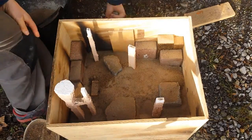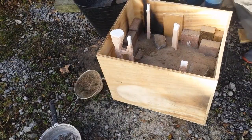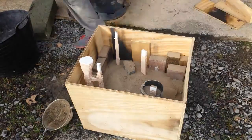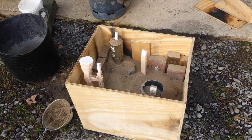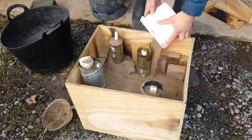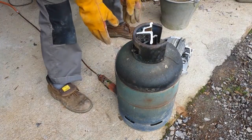We've got the foam pattern in this fairly shoddy plywood box and we're packing it round with unbonded normal dry sand. The more the sand can roll over each other the better, because when it comes to vibrating the sand into all the little nooks and crannies in the pattern it'll move better. Because I haven't got that much sand that's nice and dry like this, I'm placing these bean cans and other tubes over the risers and then filling round with sand. Similarly the bricks you can see in there — they're there because I didn't have that much sand.